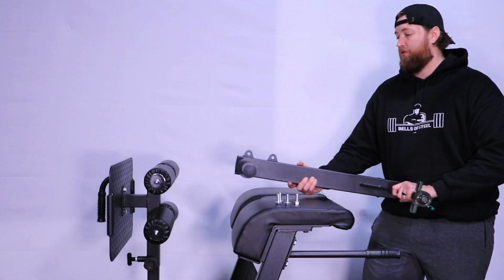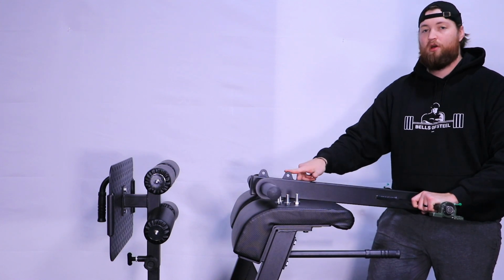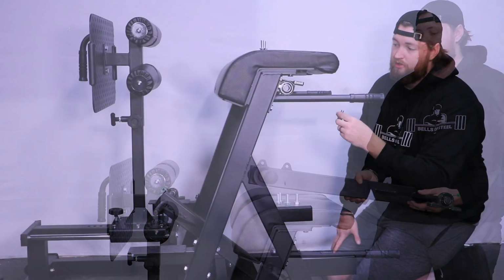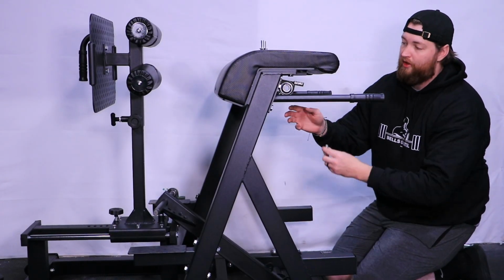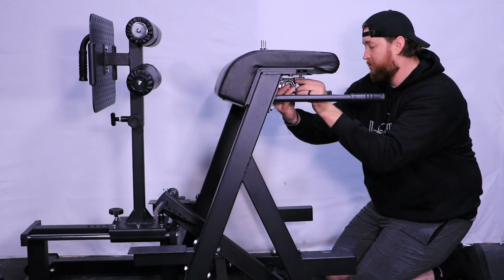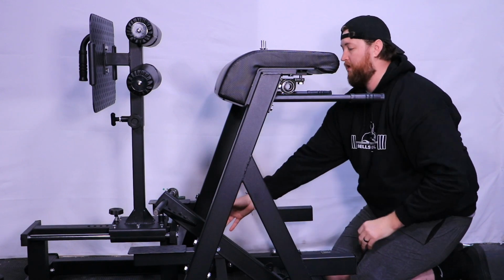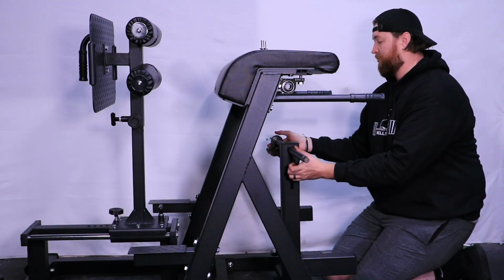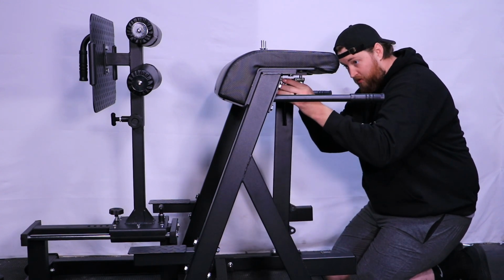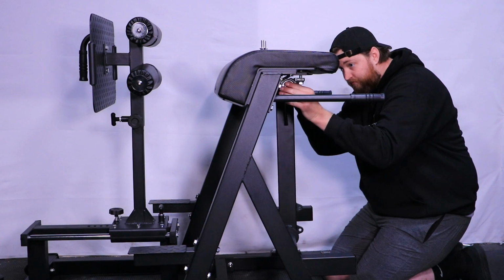The biggest thing is make sure that these clips go to the outside, so they should face away from the plate. So one of the keys, I'm going to go ahead and just put the bearing in without the actual piece. It's a lot easier to maneuver. Get both bolts in really loose, so that way you can just slide your support piece in and you don't need 7 hands. Last but not least, go ahead and tighten everything in the center that we didn't tighten down when we were trying to put the big feet on.